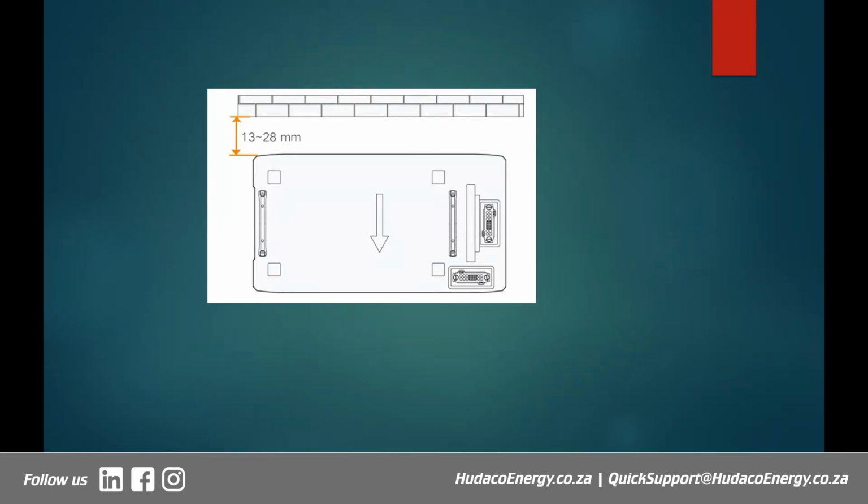The reason why we leave this gap is obviously for ventilation, and the other thing is around here you need to leave some gap for a bunch of cables that will then come in for connection with the inverter, connection with solar panels and everything else. So you need to leave that gap there. All right. But don't forget that this arrow must be pointing away from the wall. Okay. Then let's proceed.